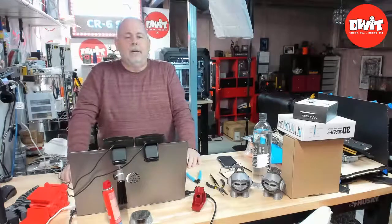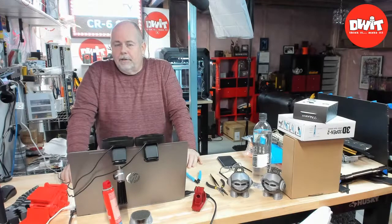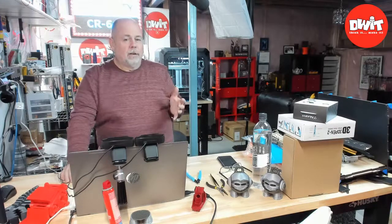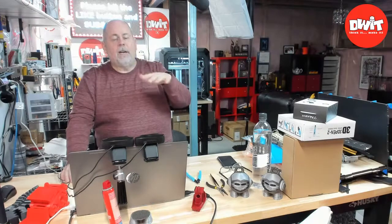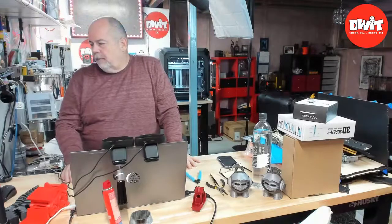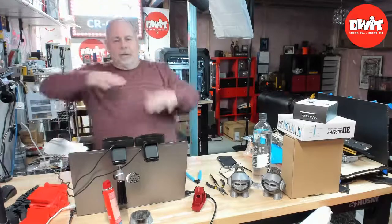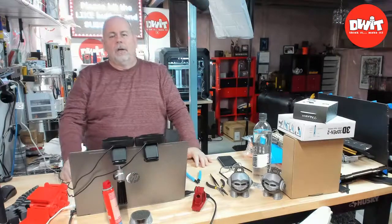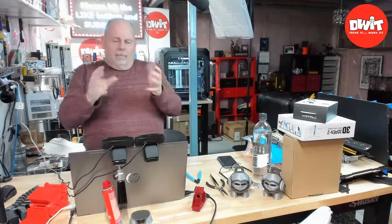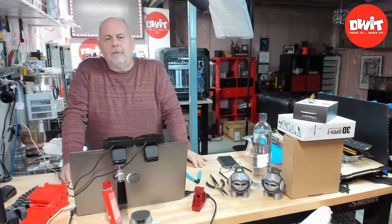But I found that I've just had to go down a little lower on that first layer. If the filament is normally a 210, I run my first layer at 220, so I get a little bit of extra melt, and I don't start the fan until layer 3. And again, a little bit of squish on that first layer, more than you might think, but not too much. It's something you will eventually figure out, and it'll become second nature. I'm still finding the odd time I'm leveling as I go on that first layer. But that'll come. It should stick fine, especially on a new printer.